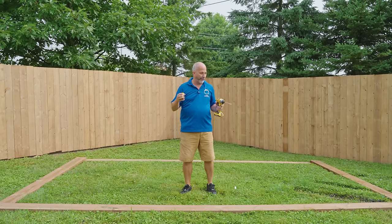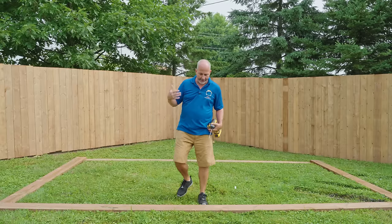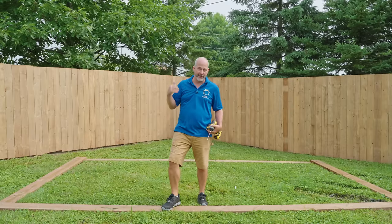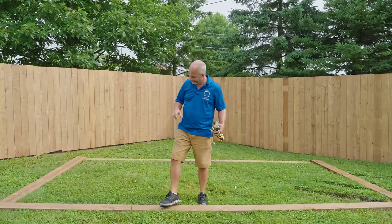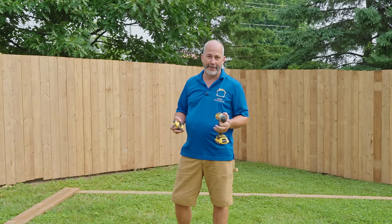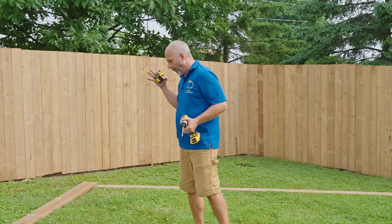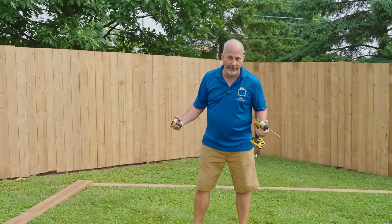So the first step of course we've got to lay this out. When I'm working on something like this I like to build my shed base like I'm making a deck — I want it strong enough to carry the live load and the snow load in the wintertime. Being up here in Ottawa, that's always a big concern. The camo blocks we're using today are rated for 1800 pounds each, so that's more than double the strength I need for a structure like this.